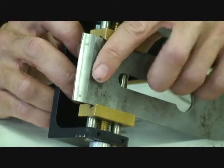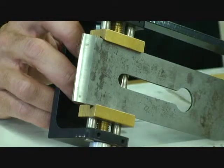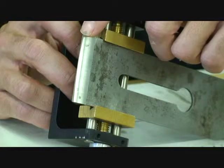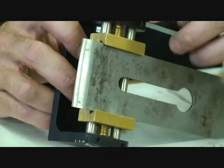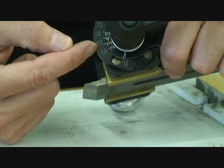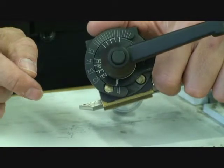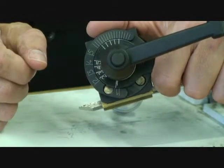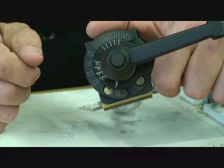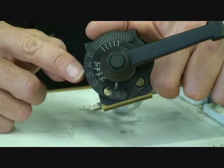When you set the tool on the wheel, if your stone is half an inch thick and you're sticking the blade out approximately 5/8 to 1/2 an inch, and you line up on the side of the grinding hone — line number three on the outer part and number three on the inner part — you should have very close to a 25-degree micro bevel. If you need to make a small adjustment from that, there is a vernier scale on the side of the jig.